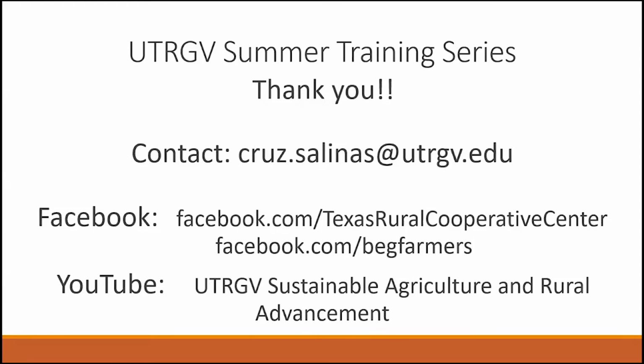I guess the main reason is because the plant will grow up to about 20, 25 years if you take care of it. And even though a cedar post or a treated lumber is designed to withstand the weather and the water from rotting, it will not last more than 7 to 10 years. And at that point, that's when your dragon fruit is in full production, and you're probably going to have to replace it, or the post is going to break or something like that. So the best thing to do is go with a concrete post.